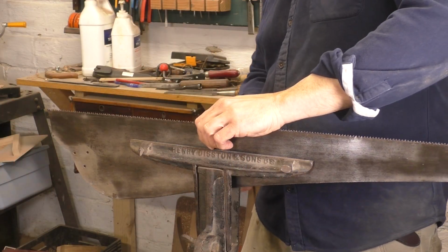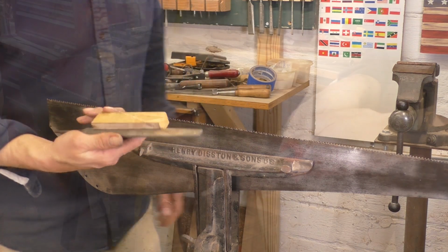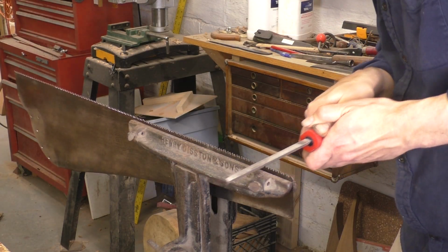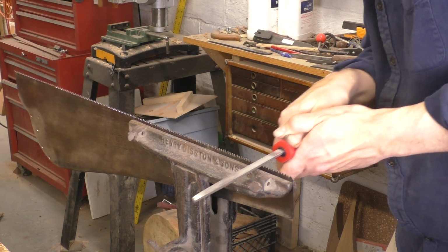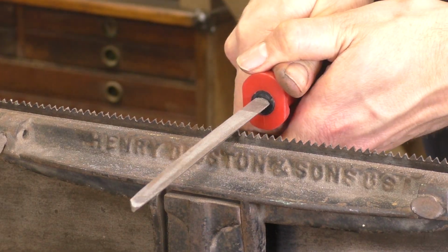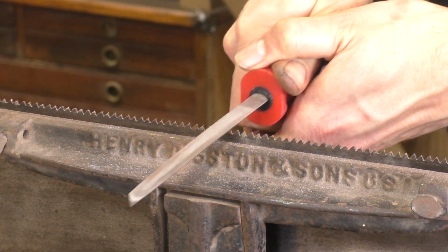Now, the saw gets jointed again, but very gently this time, and I'm doing the final sharpening. This time, it's important for each tooth to get the same number of strokes. I'm doing 2 per tooth. By the end, the teeth don't just feel sharp on the hand, they're also grabby. They tug on your skin like cat's claws. That's how I tell when my saws are really sharp.